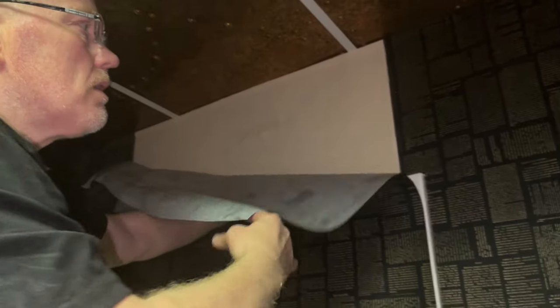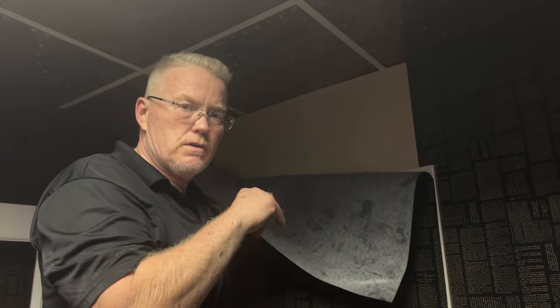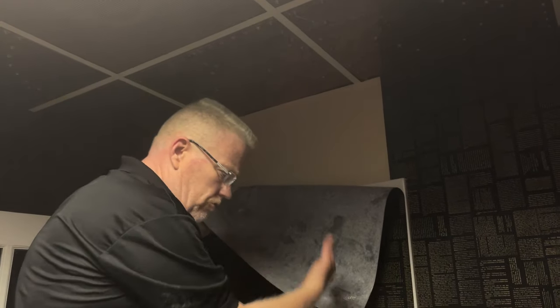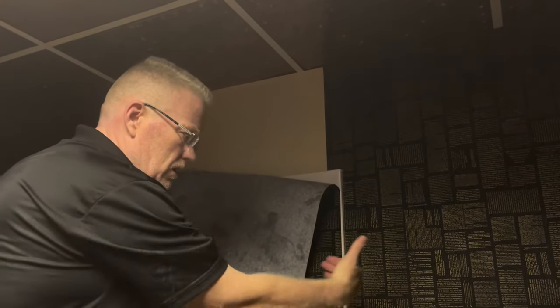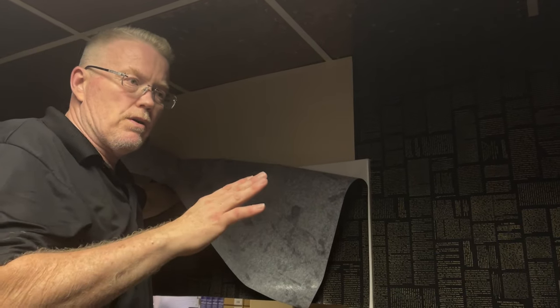The fake out. We started over here. The last piece, when we join the first to the last. Now, I didn't want to waste all this product and drape a piece of waste over this doorway only to throw it in the garbage. So what I did was I started 2.5 inches over the doorway, figuring that I would have enough wallpaper to play with to make my fake out or to make my kill point.